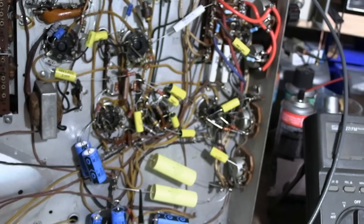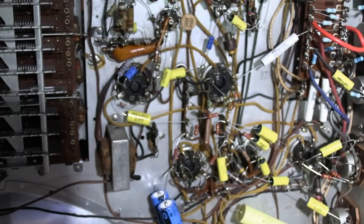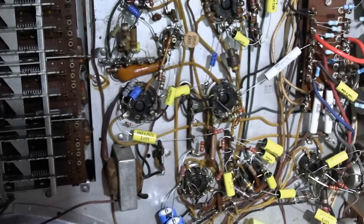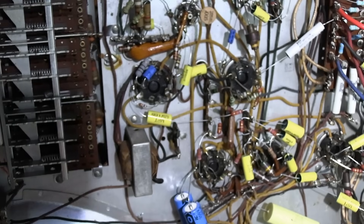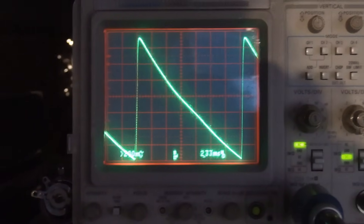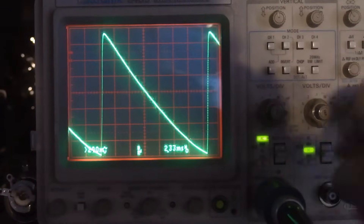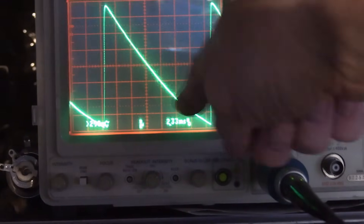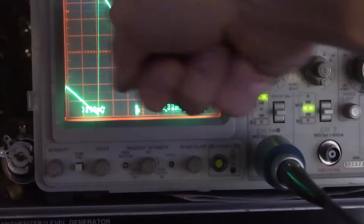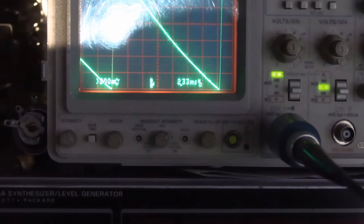I've fired up my scope. Let's take a look at the sawtooth waveform. On one side we have high voltage; on the other side we have low voltage — low voltage being a relative term, since the sawtooth waveform is several hundred volts in amplitude. I pulled out my new x100 probe and here it is on the scope — I try to maximize it so it fills up the screen. And yeah, it's a little saggy towards the bottom. This line should be as straight as straight can be, and it is not.